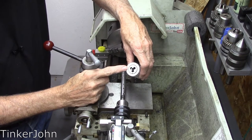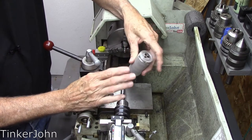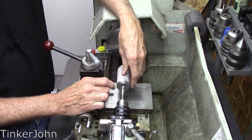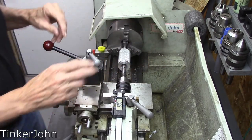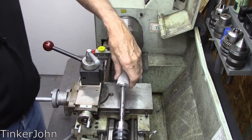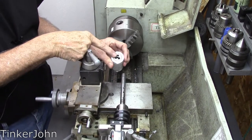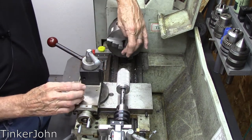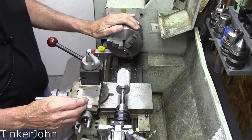What I've got here is a quarter by 32 die. I use the tailstock die holder that I've made — they're easy to make and I really encourage you to make one. All it does is slide along this rod and you can pulse the lathe and get it started to make those threads. After I've run the die up on one end, I reverse the die so I can get just a little bit closer to the shoulder. The next step is to drill a one-eighth inch hole through about three-quarters of an inch, so I'll go ahead and get everything set up and do that.